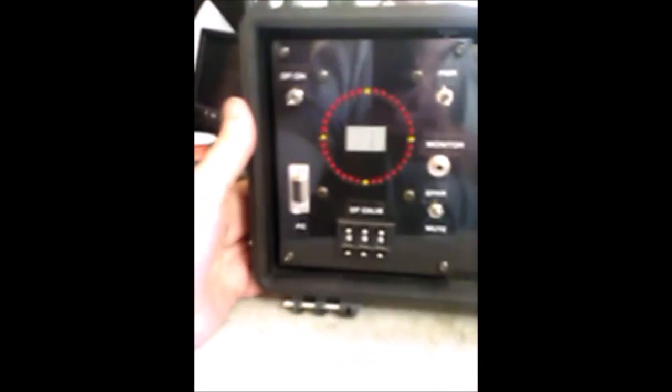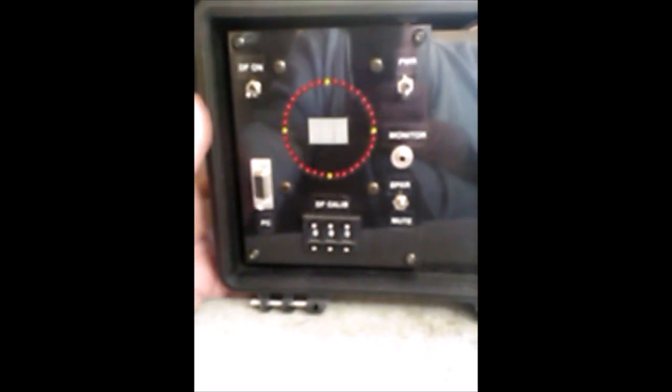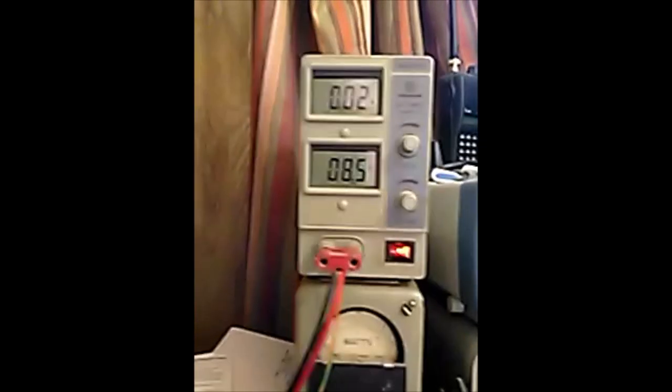Right now I've got an external DC power supply hooked up to the unit, but it's not turned on yet. I'm giving it about eight and a half volts, which is really enough to run it — you need at least seven volts. You can put in more than 15 volts; I'm not entirely sure how high you can go, but I wouldn't suggest more than 24. I'd recommend keeping it at 15 or less.